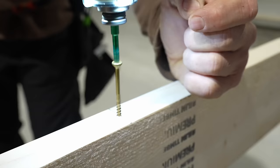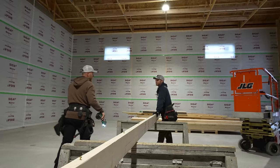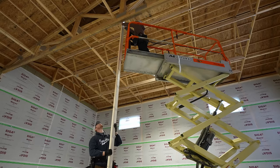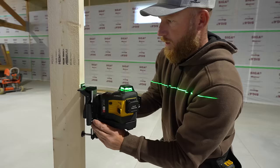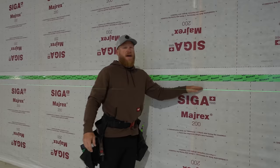This is just to do as much prep work as possible — let's do it. It's actually not bad in here at all. I feel like it's warmer today than yesterday, probably because it's colder outside. Now that we have our story pole with a screw at every two feet, I should be able to take my laser, hang it on here, and very easily micro-adjust it. Now I have a laser going around the building right where the top of my girt's going to go. When we get to the next row we'll just move it up to the next one.